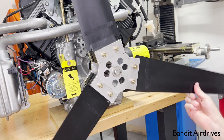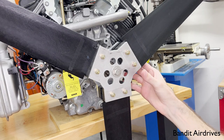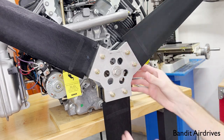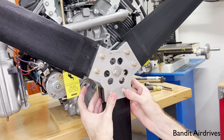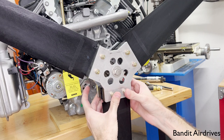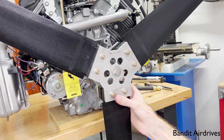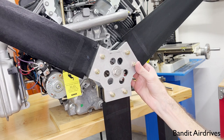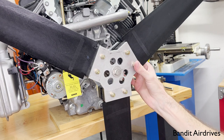You don't want to exert any real clamping force or real torque on this safety bolt — it's just a safety keeper. After that sets up, you're ready to run. At this point, if you didn't fully torque the propeller bolts — these six bolts — go around two clicks on each. Now would be the time to make sure you get final torque of 115 inch-pounds on each of those bolts a couple of times. Remember to check these after a run-in, after a few minutes and after a few hours.